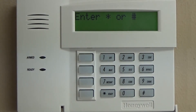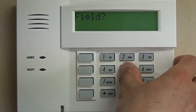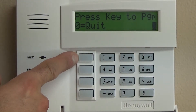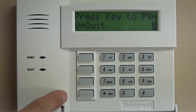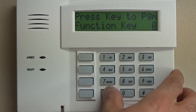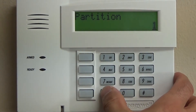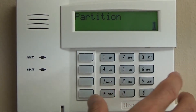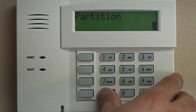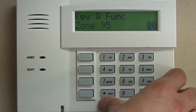After that we're going to go right to programming the speed keys, which is star 57. These are identified as A through D — so this is A, this is B, this is C, this is D. We're going to start with A and enable that. Partition 1 — for most residential systems there's only going to be one partition. I strongly don't recommend complicating it with multiple partitions unless absolutely necessary. We'll leave that as fire.